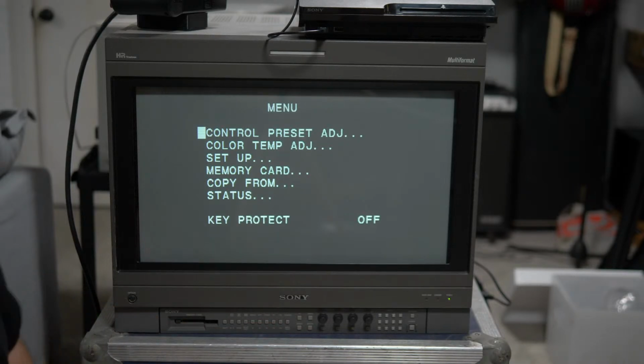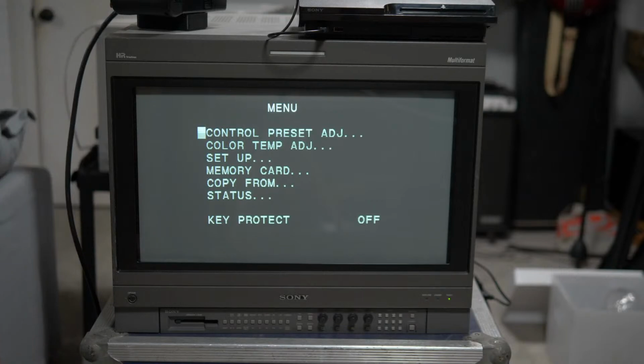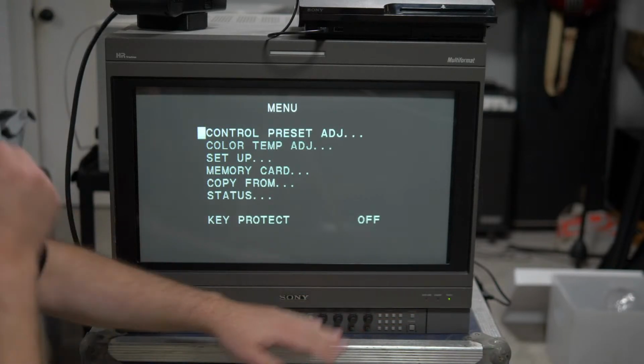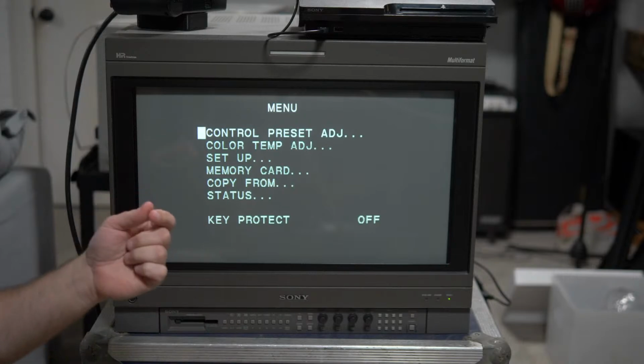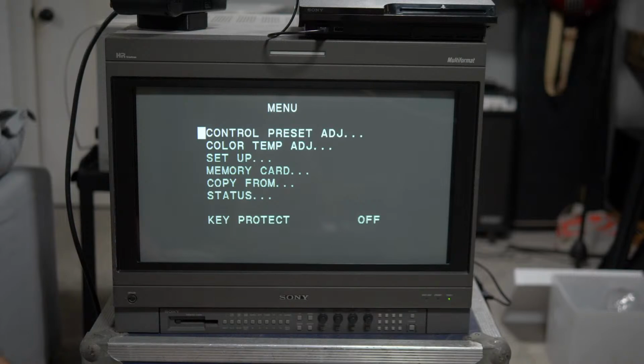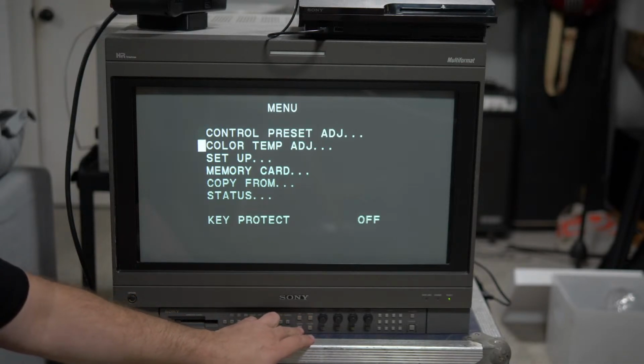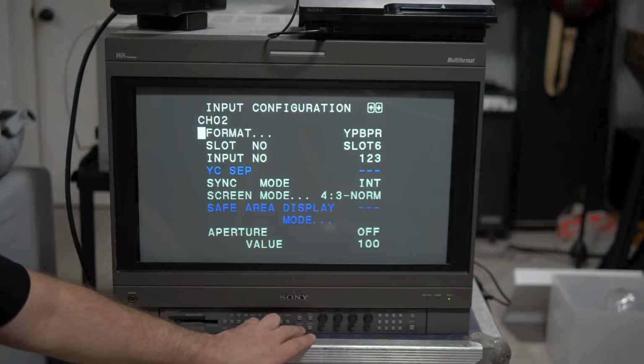I think the reason was when you were in a... and this is a 100% guess, this could be total bullshit. But I think the reason is that when you're in a pro environment, you want control over absolutely every piece of it. So if you want to just connect one monitor, cool. But if you want a daisy chain, then you remove those and you put them on the other monitor. And if at any point things look weird, you throw out your terminators and buy new ones, and you want control over every single piece. So that's just my guess, but it would make sense. That's what I would do.